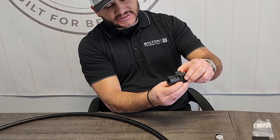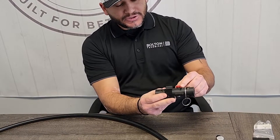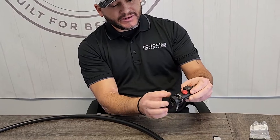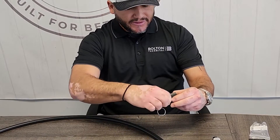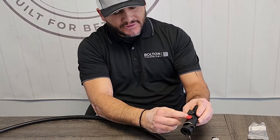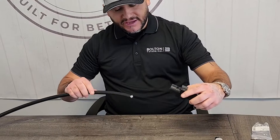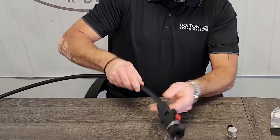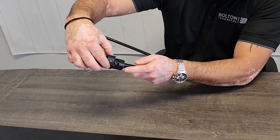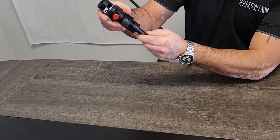This tool here cuts the cable. To make adjustments when you're terminating, you have this lever here that you can unscrew and move back and forth to make adjustments on the termination. I'm going to insert this LMR 600 cable into the prep tool like so, and then I'm going to lift up on the termination tool and make sure it gets a snug fit.